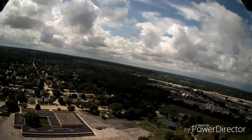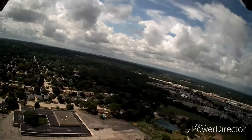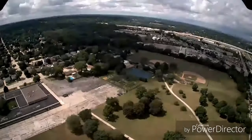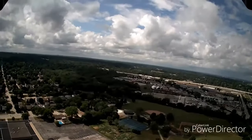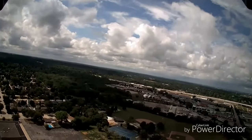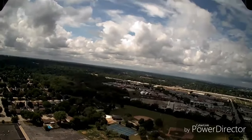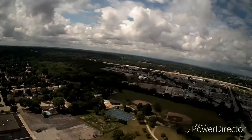As far as right now, I'm not totally impressed with the camera. I was also having some issues with the articulation — it's supposed to pitch down 90 degrees and then pitch straight up again from the transmitter. There's a dial on the transmitter that does that, but it wasn't working out so well today. It wasn't pitching all the way down the way I wanted it to in a couple of locations, so I have to take a look at the servo and make sure everything is connected properly.